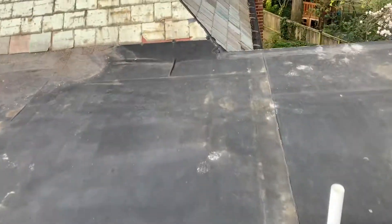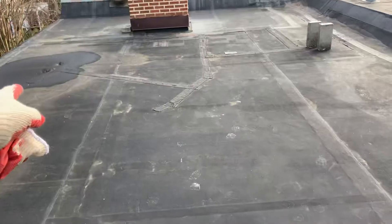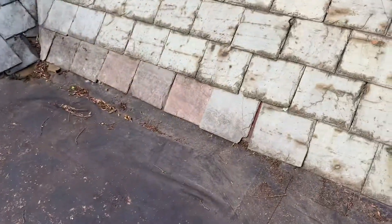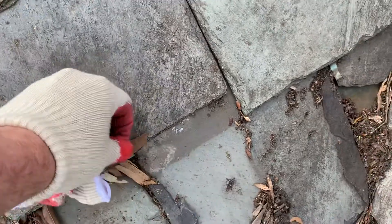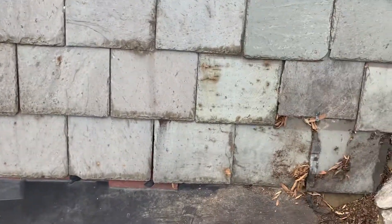I don't think I'd be so inclined to do that today. I'll put some cement on that, maybe give you some respite, but I would just replace this roof. As I look around there are some slates that need to be changed — especially that one right there. The membrane wasn't installed properly in the first place.